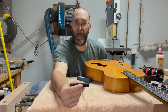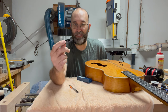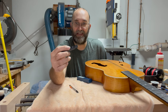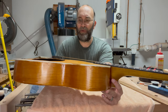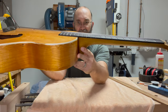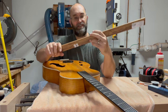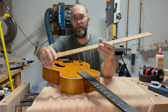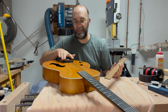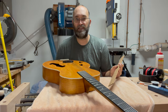It's unfortunate that one didn't work out. But given the difficulty I had carving out the slot, I think I'm going to be way better off if I can figure out the exact right height of what I need to put underneath this. In putting the archtop top of the bridge here, I think this is almost the right string height — it's probably slightly low. So I'm going to use this piece of eighth-inch Chechen wood, cut off a piece, glue it to the bottom, and that should be more than enough height to where I can go back and sand it down to set the correct string height.